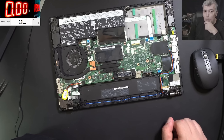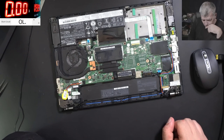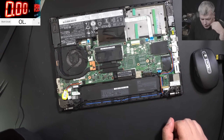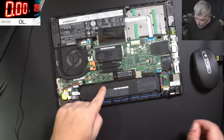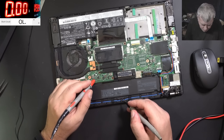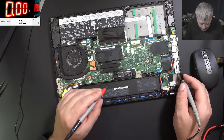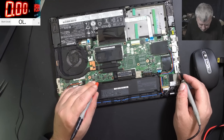Do you think actually this laptop has a power supply which is creating the main power rail? Because that can make sense. So the main power rail is not shorted, but on the input of the MOSFET it is shorted. Let's check something together — so the main power rail, one more time: this is plus, this is minus. This is not shorted.